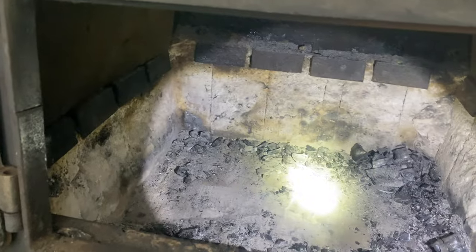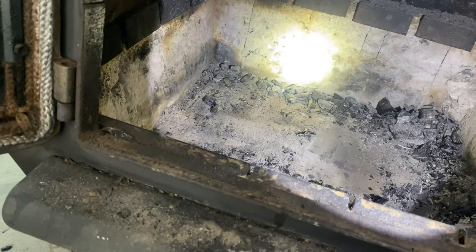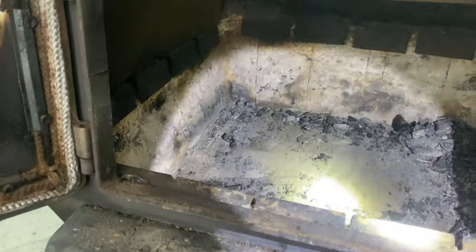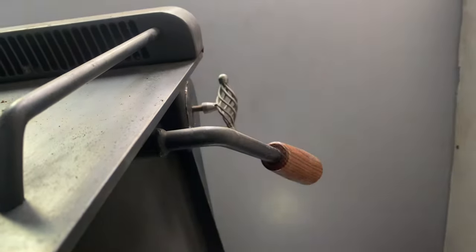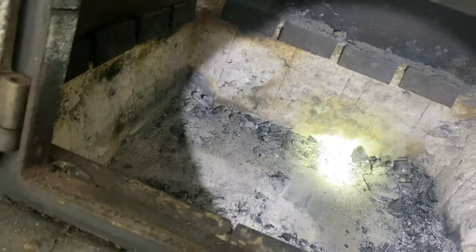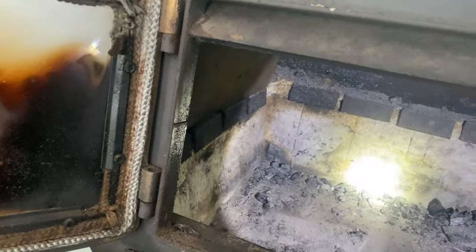The reason I did this is because the stove was holding a flame and was very controllable, until one night it wasn't. I think it's mostly because I let the fire go out and all that creosote was building up because there wasn't enough to keep it going. I messed with the air intake and the temperature gauge, but I looked online and came to the conclusion that the combustor was the reason — I could not get it to glow or get the stove to heat up past 300 degrees.